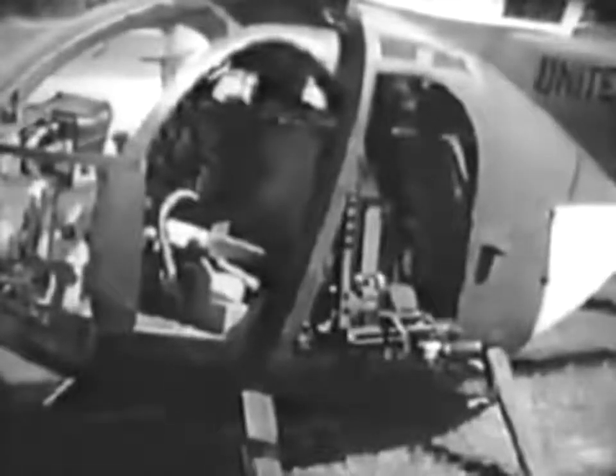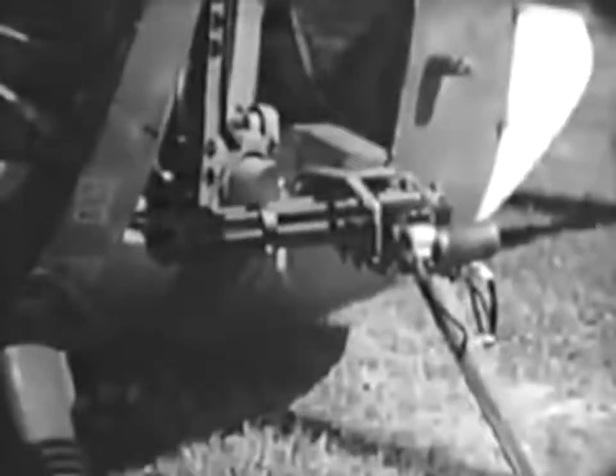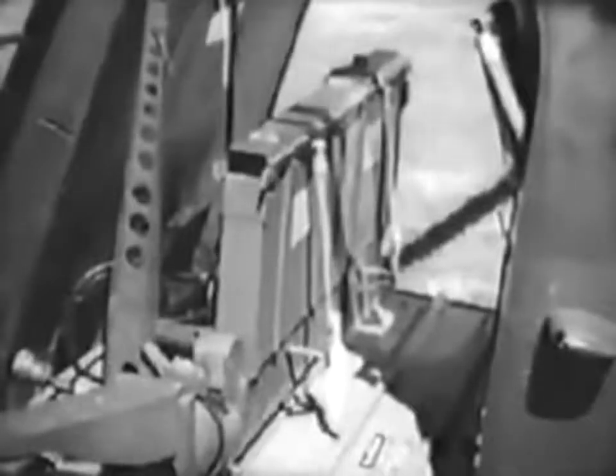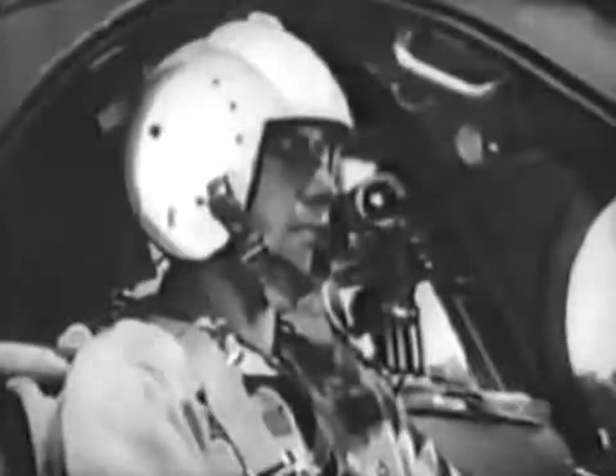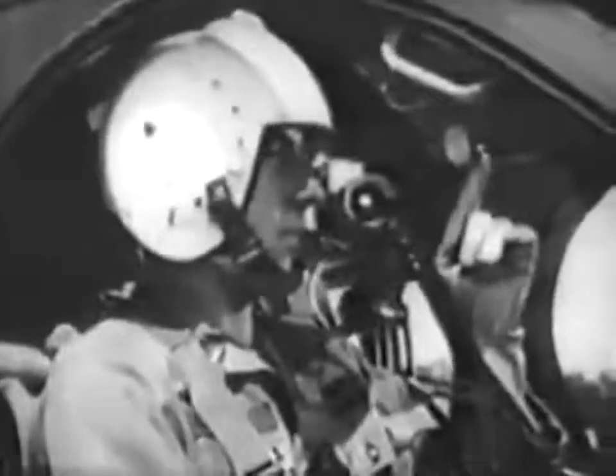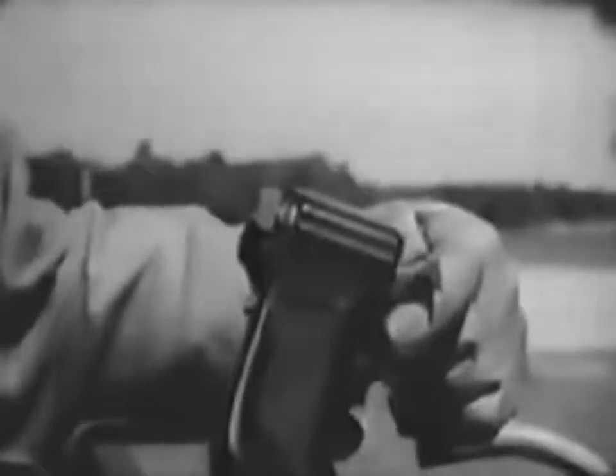The aircraft has provision for mounting armament kits on the left side. The machine gun kit consists of a 6-barrel minigun with selective rates of fire. Ammunition is carried in a narrow box near the forward bulkhead. A mechanically linked gun sight is used for aiming the minigun. The weapon is operated by a trigger and a gun elevation switch on the pilot's or co-pilot's cyclic stick grips.